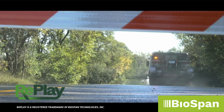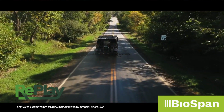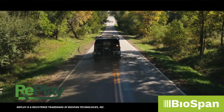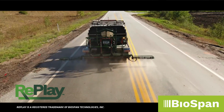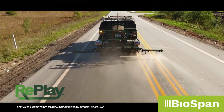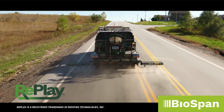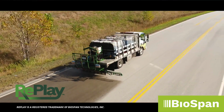It did. So they tested strength and all that, but did they actually look at the asphalt to see how deep the RePlay was penetrating? They did. They got creative. Used black lights and blue light flashlights. It was like a CSI investigation for asphalt. They could see RePlay penetrating at least an inch deep, and they even found evidence suggesting it went even deeper than that. Really? The asphalt was temporarily softer at greater depths, and there was a noticeable citrus fragrance, plus some oil residue, all indicating the RePlay was working its magic.